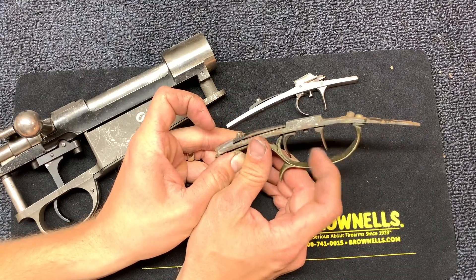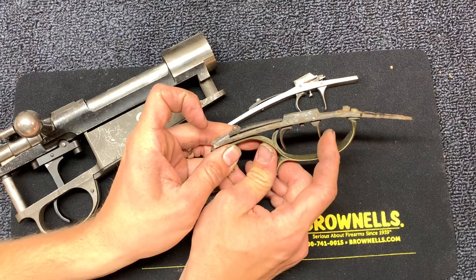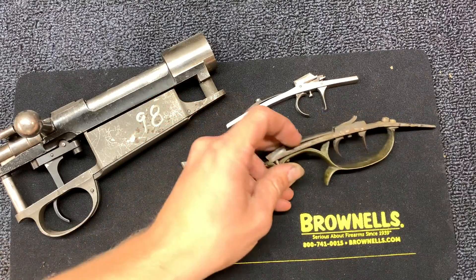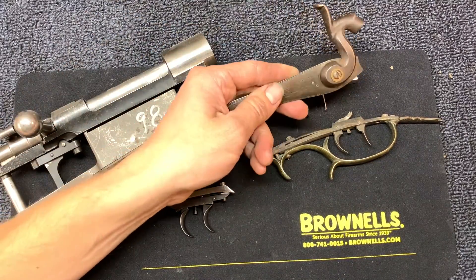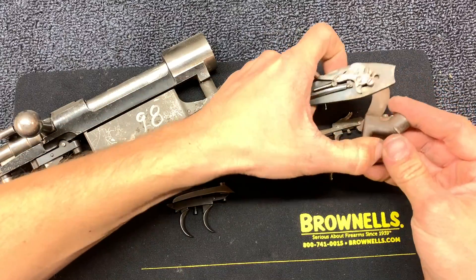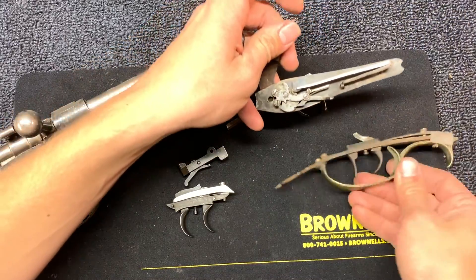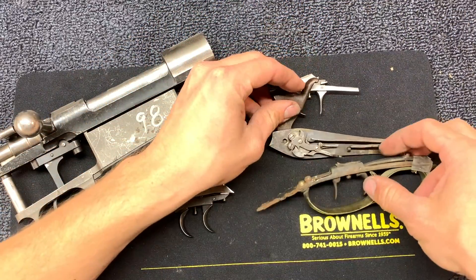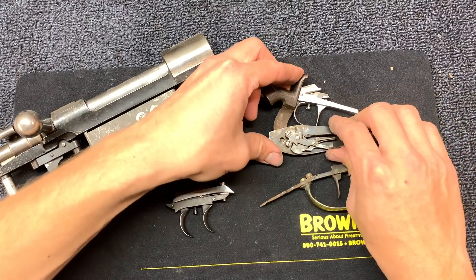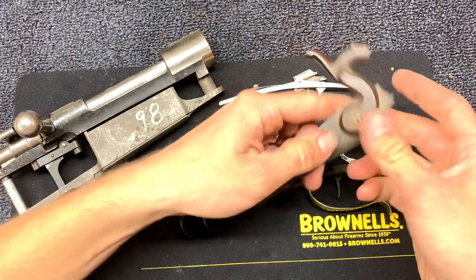This would set, and this little hand here on a flintlock is basically what you're slingshotting and sending up. This is the lock to this trigger mechanism. We have it in full cock here — flip it around, this would be sitting right in here. So when this gets tripped, it would push your sear here, and that would let down your hammer.